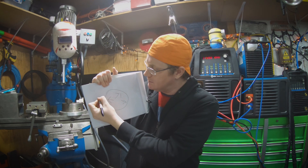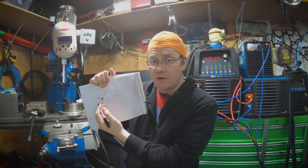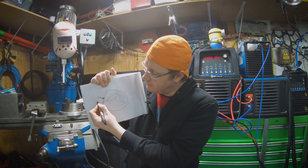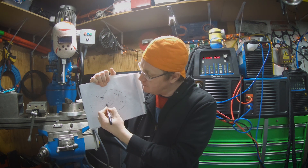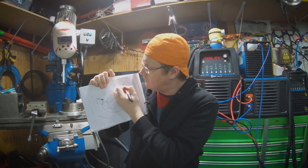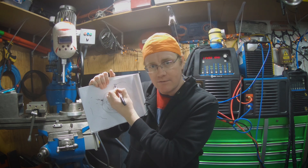What you need when welding this stuff is enough gas on the inside of the tube pushing out. As you come along with your TIG torch and you're zapping it, you've got your puddle right there and then a small trail of metal behind it that has yet to solidify. You need enough argon pressure on the inside — higher than the atmosphere outside — to where it'll bow out very, very slightly. Because as that weld puddle cools on stainless, it will shrink back down. You need enough gas in the pipe to float your weld puddle on.